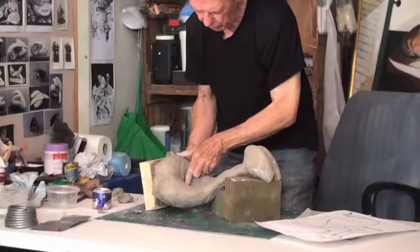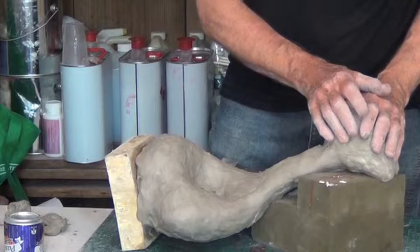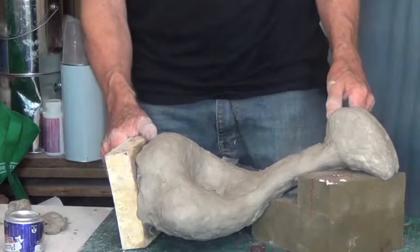So I seal that hole off like that. Then I pour the plaster of Paris in layers. Then I add a little bit of scrim, which is like Hessian, to give it strength. And then a last layer of plaster of Paris again. And then that side is done. I let it dry. I can show you one side. And that's what you get. That's one side. Okay, there you go.